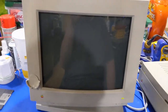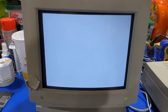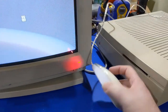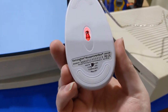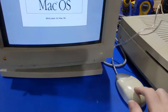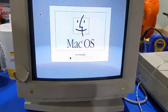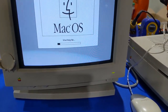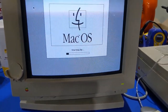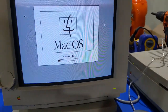This is not ideal because it takes up so much space, but it is what it is. Let's power this thing on and see what we get. That's better. I didn't get a keyboard or anything — all I want to do is test the floppy functionality — but it looks like we're booting. I'm wondering if the issue with the LCD monitors was the refresh rate. I think these machines run at 67 Hz, not 60 Hz, and that might be why the LCDs kept showing out-of-range errors.